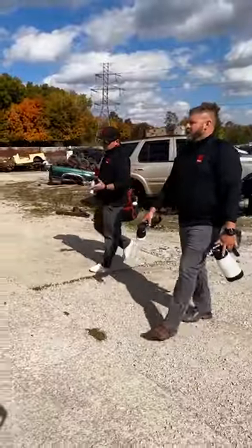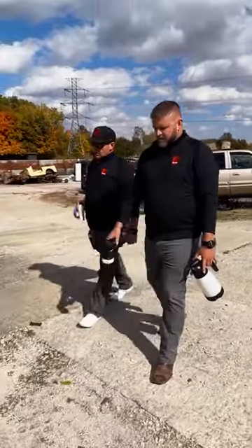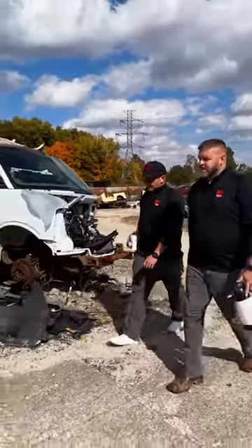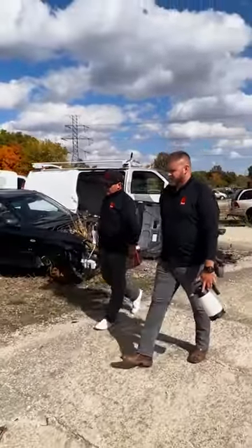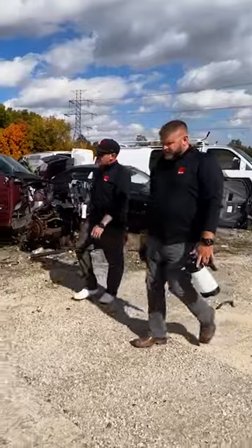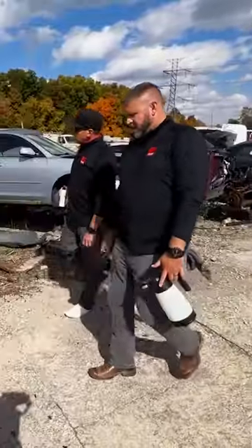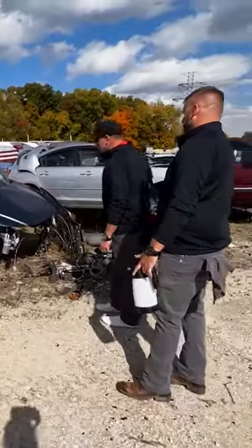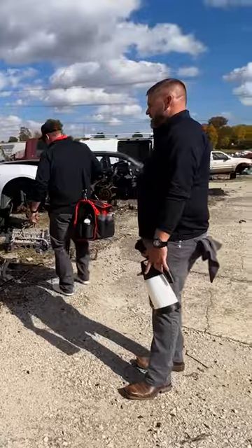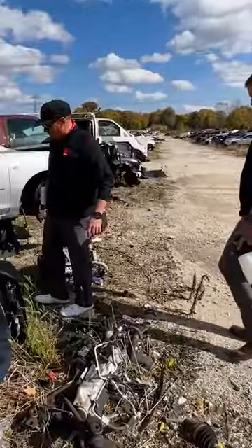If you're doing metal polish, what's your recommended pad? It really depends — metal polishing is a lot different than paint polishing. There's a lot of variation in how hard or soft the metal is, whether you're on aluminum or stainless. I usually start somewhere in the middle, like a yellow wool or yellow microfiber. I've had some success with the blue wool because it has a shorter fiber on it and doesn't get quite as messy. There's no doubt about it that metal polishing is messy — that's always part of it.